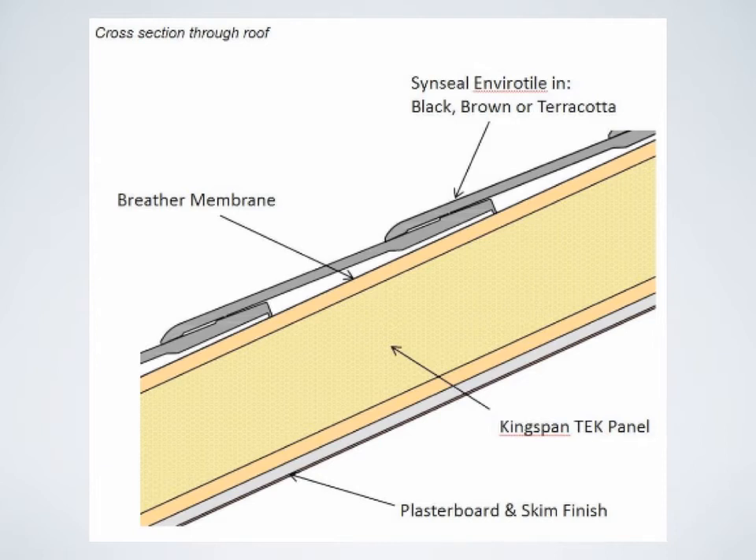Let's take a closer look at a cross-section of these panels. The panels are made by Kingspan, one of the most recognized names for insulation products in the UK. They consist of a high performance rigid urethane insulation that is sandwiched between two layers of OSB board. When Kingspan manufacture the insulation they bond the OSB board to that insulation. Each panel can be cut to size in the factory. The roof panels are 140mm in thickness and once erected on site will be finished with tiles externally and plastered internally.